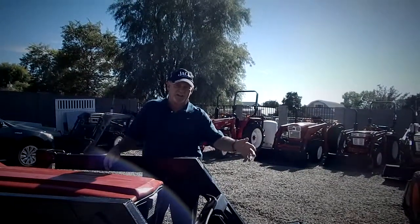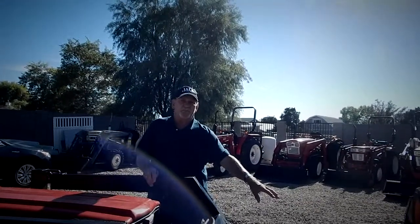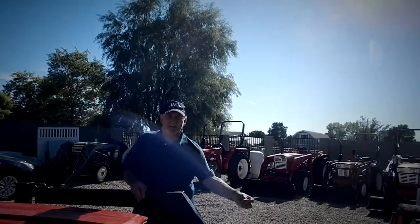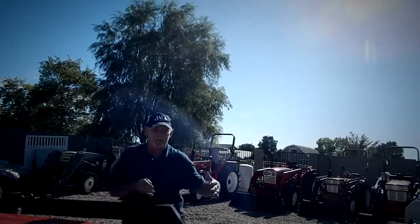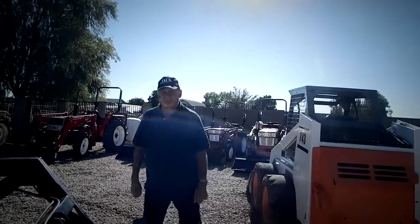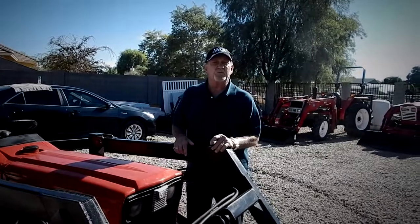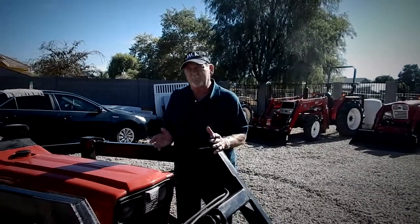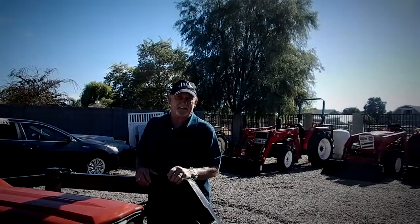There's a third weight, and that is if you put forks on the bucket. As an example, if you filled this three-and-a-half-foot bucket up full, it'll pick up 375 pounds of gravel. If you were doing the dead weight lift, you'd have about 500 pounds. If you put forks on it, you're about 400 pounds. The further that you get your material out in front of the tractor, because of physics, the less you'll be able to lift — it's the counterbalance and the ability of the pump. So this would be a good tractor for emptying stalls, hauling manure, lightweight stuff. This would be perfect for somebody with one to three acres who wanted to muck out stalls, work your arena, do light landscape work, disk an acre, mow an acre, work your driveway. This size bucket will get you into a stall relatively easily to clean and muck.